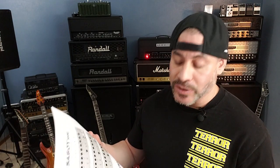Then the switches, there are 4 toggle switches that you can play around with. One is bright, self-explanatory. You probably have an amp that has a bright switch. If not, this switch introduces a small bypass capacitor to compensate for dark sounding pickups or provide a more aggressive attack. The next toggle is the grit, and that's a 3-way switch. In the up position, the traditional Jose clipping is engaged. The center deactivates all clipping modes. The last is the downward position, and that's the custom design clipping mode that AJ calls the Phoenix.